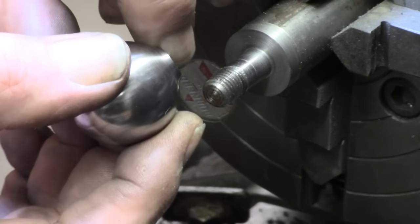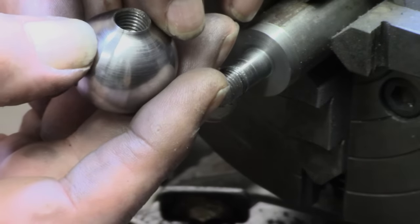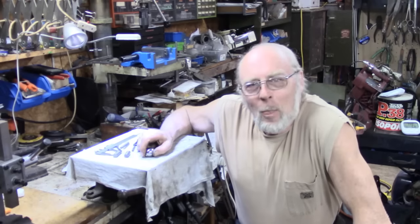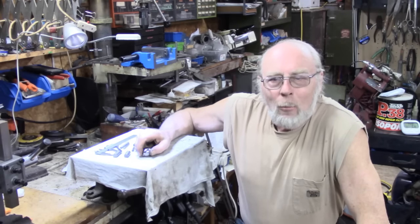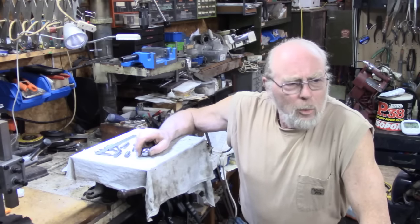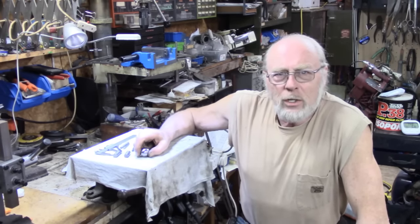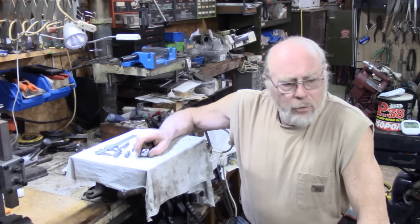I'll just finish this off with a quick rundown. Tell you what, if you've stayed with it this far, you've done very, very well. Goodness knows how long it's going to be when I assemble all the clips. But yeah, we've gone through various stages of not so good and problems, but I must admit the time I spent making the tool holder and setting it up so there was less tool projection, and another grind, I think I've got the angle fairly good. It's probably about 1 or 2 degrees, I think.